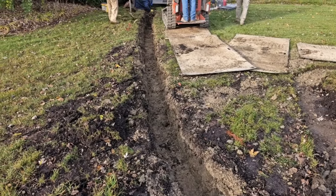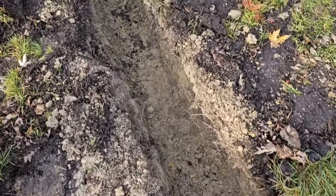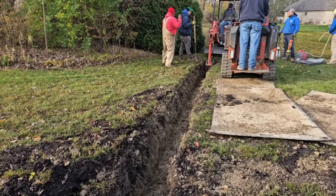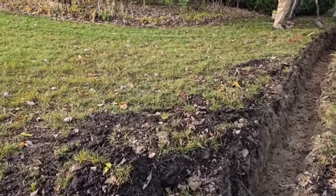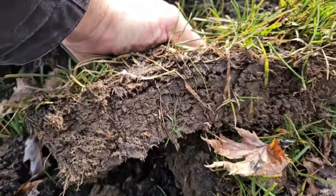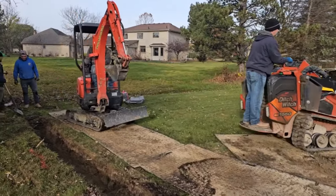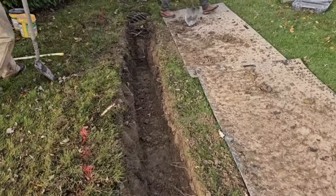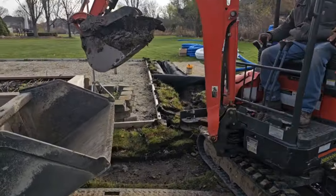This is a beautiful French drain. Look — the guys dug out all that soil and hauled it all away. You don't see piles of soil on either side of the trench because we're getting rid of all the soil. We're not going to keep any of the soil. The men cut the sod off with a few inches of dirt so we'll be able to grow grass on this French drain. None of the soil is worth keeping. If it was permeable, we wouldn't be here.